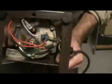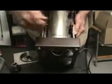So it seems to me that what has happened is that the corrosion that developed from whatever leaks over here, both of these on the P-stat, has corroded all of the other parts in this machine, and corrosion is what generally causes these terminals to melt away to nothing. And so we've got a lot of cleaning. Every one of these terminal ends is going to have to be replaced, if not the entire wiring harness. It'd be easier to replace the wiring harness.